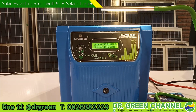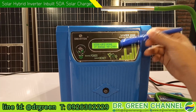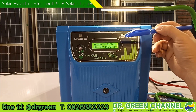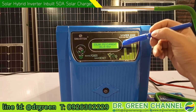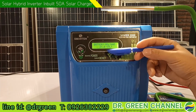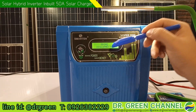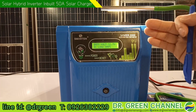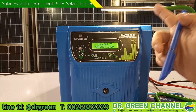Okay, let's look together at the status again. This is the information with the default setting from the factory, the dip switch setting, where the solar is available. The solar is coming with 1.5 ampere charging current, and this is the battery voltage. The battery is already charged, and the mains is disconnected, so it doesn't require any additional power from the grid. So this one runs 100% on solar.